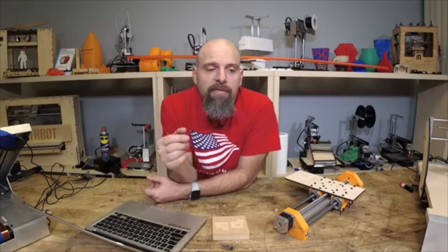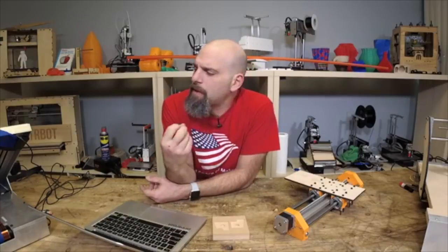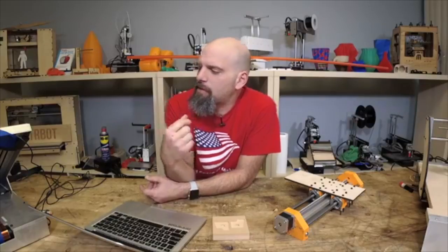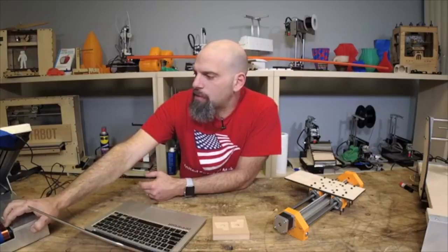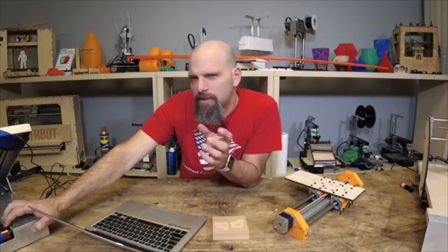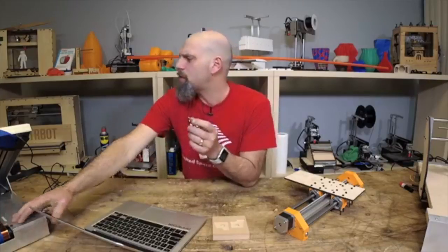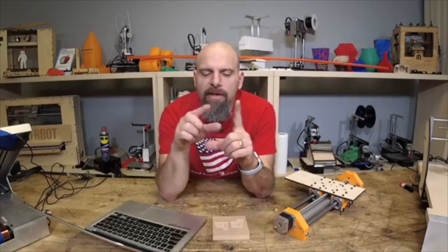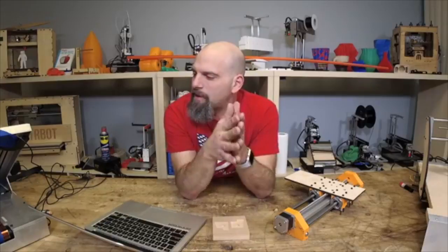And that takes time. So the things that I really need, I think I can just lathe here and maybe CNC here, but it's going to be a little bit of a lead time till I can get a little better coupling on my rollers on this. So I think it's got a set screw that's skipping every once in a while. So I'm getting these really strange shapes when it's supposed to be a rectangle. It's kind of like a zigzag, like it'll move over a little bit. It's just not advancing that Z.